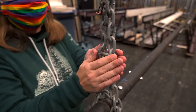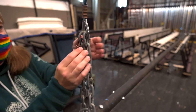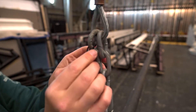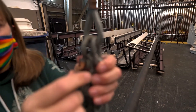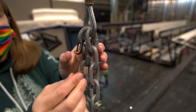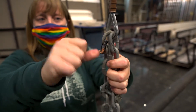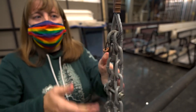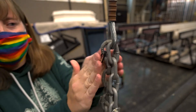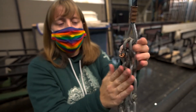If you do have the bolts, next time you have a rigging inspection done by a qualified inspector, they'll let you know if they need to be removed. The other thing to point out is how this shackle has a plastic zip tie — this is called mousing. It could also be done with bailing wire. Mousing ensures the pin of the shackle doesn't back its way out with movement as things fly up and down. It's very important to have some sort of mousing method if you have a screw pin anchor shackle, which is very common for trim chain assembly.